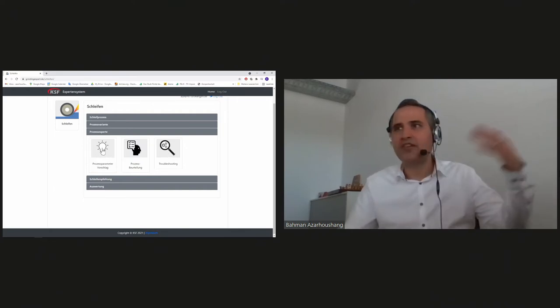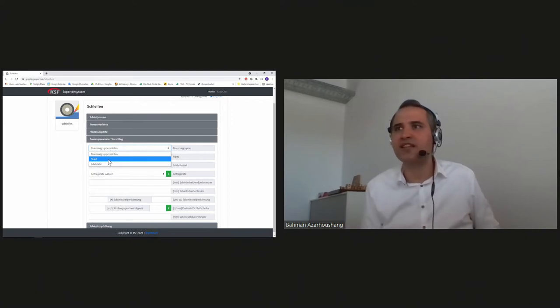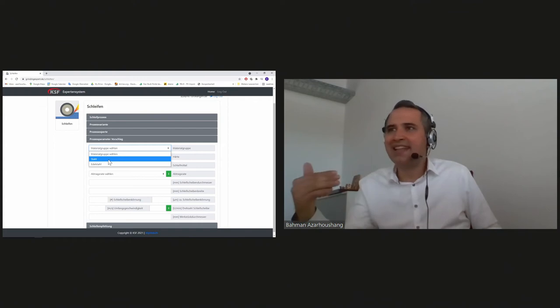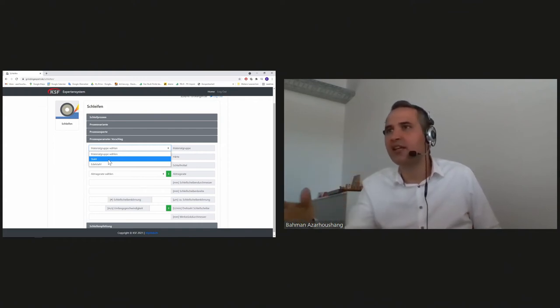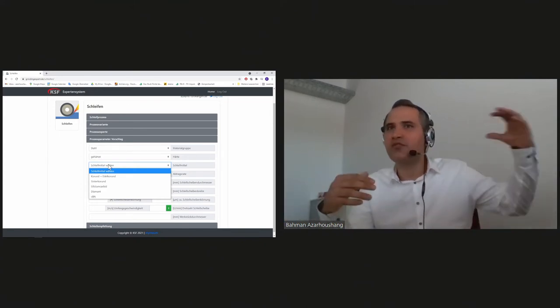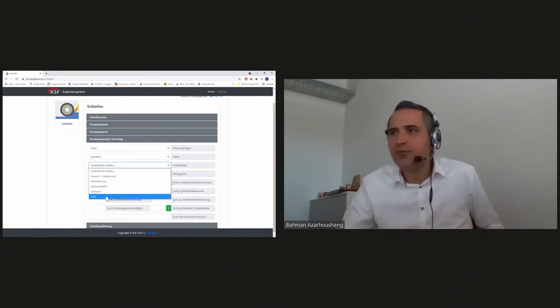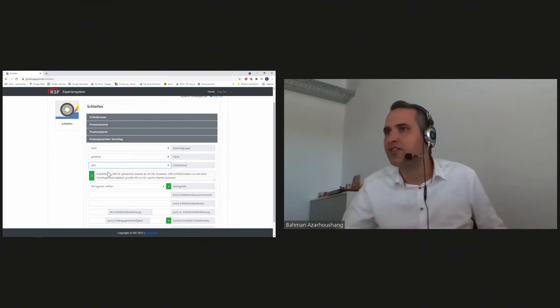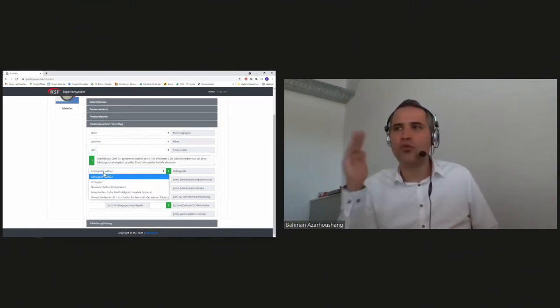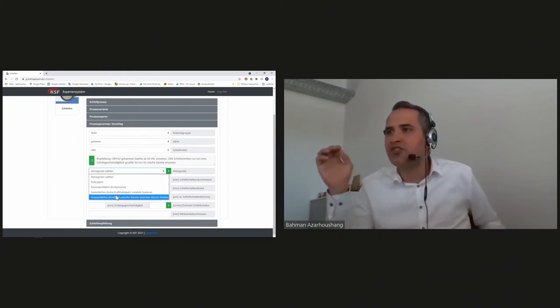Let's start with the suggestions of the parameters. So here you should choose the workpiece material. At the moment, we have two types of materials, a steel and a stainless steel. In the coming weeks, we will add other materials like ceramics, cemented carbides, titanium, and then the material groups will be updated. So I choose steel and hardened steel, for example. You can choose the abrasive of the grinding wheel that you're using, because the grinding wheel itself will be chosen in another module. But here you have the possibility to choose whether you're using, for example, corundum or CBN or diamond and so on. So let's choose CBN; for hardened steel, it is always a good choice. And then you can decide whether you want to do roughing, semi-finishing, finishing, or even polishing, as I say, as a process where you achieve the best surface quality.